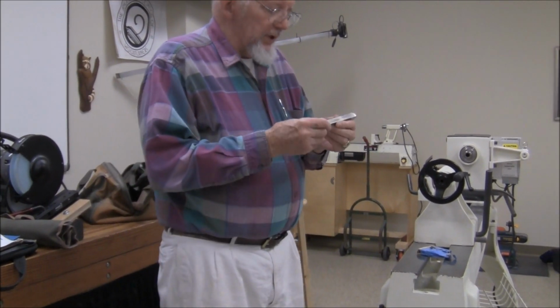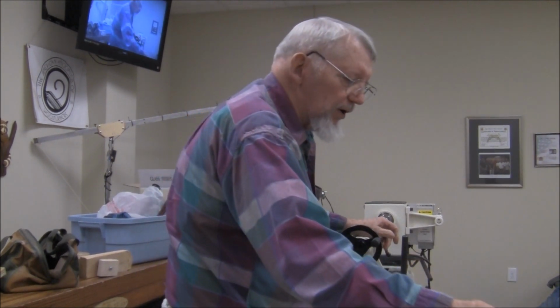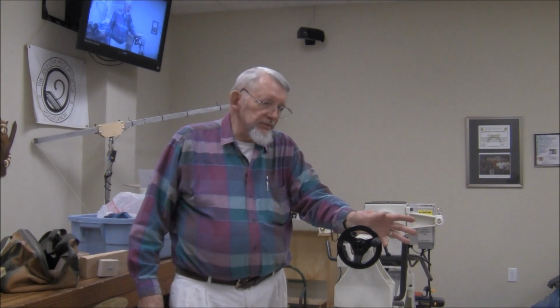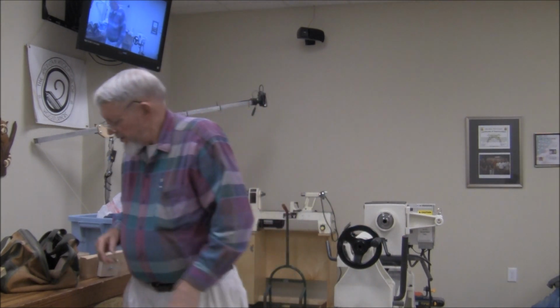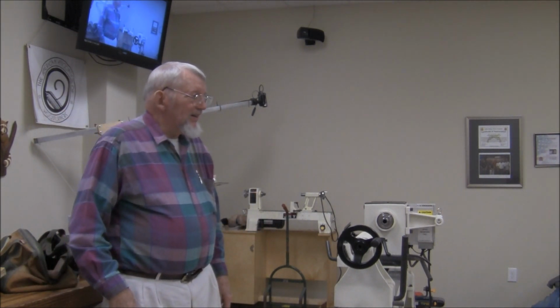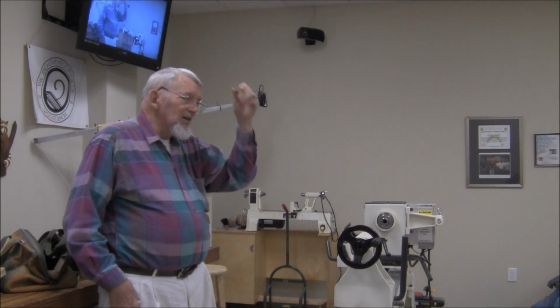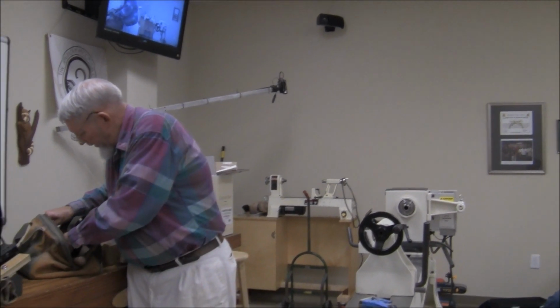The metal tool bits can get pretty good size. If you want a really stiff scraper, that could be brazed on a piece of 1018 or just cold rolled steel. That's high-speed steel. That's about $14 or $16 for that bit, I think. Yeah, those are getting pricey. Because when I started, these quarter-by-8 was not like $1.50. They jacked the prices up.